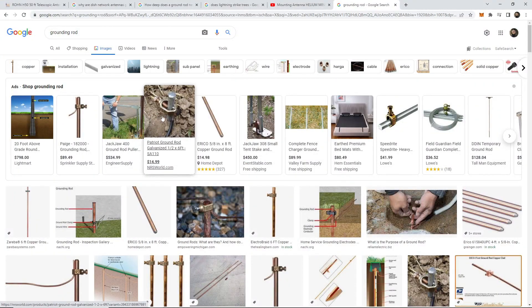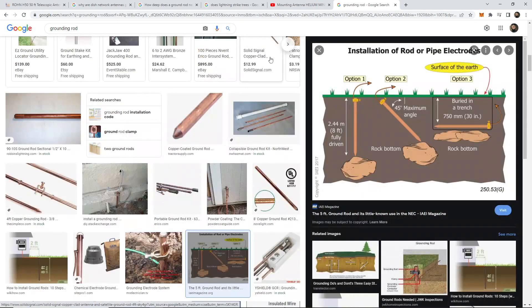If you look up grounding rod, you can see pictures of what's going to happen. This is what it actually looks like - 8 feet deep like this, or 2.5 feet if it's horizontal. I mean, you could do a mixture of both in between. In my previous experience, all the land feels completely different. There's some land that after digging I'm like, I'm surprised I don't sink through this. And then there's some land where I feel like I just started digging into a rock.